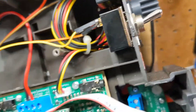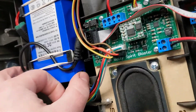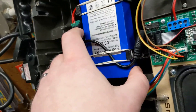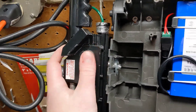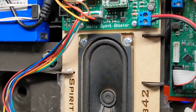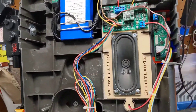The interactive mode jumper is on or shorted. Procedure should be this: turn the interactive jumper on, battery pack on, wand on. Okay, now we should be in interactive mode. Hopefully when I'm talking, we'll get a noise that comes out of this thing, like a monster or a ghost. I can fire, and then you can see what happens. It's pretty cool.